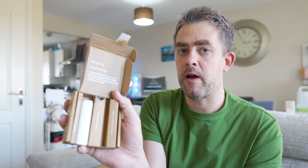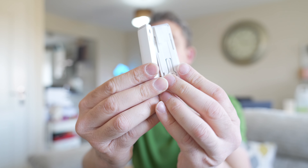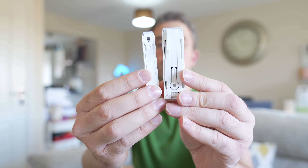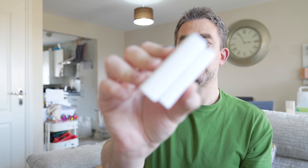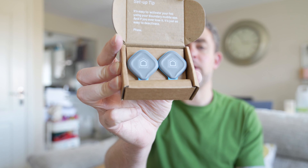Contact sensors - so these will go on your doors or windows, wherever you want to put them. And obviously you can add additional ones from the website. The space between your contact sensor and magnet edge to edge should be 25mm max - that's 2.5 centimeters. There's an area for the 3M stickers to stick to a window or door. They're slightly bigger than the SimpliSafe ones in terms of length, but maybe not as wide or chunky.